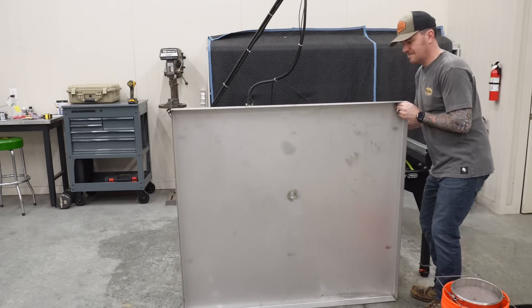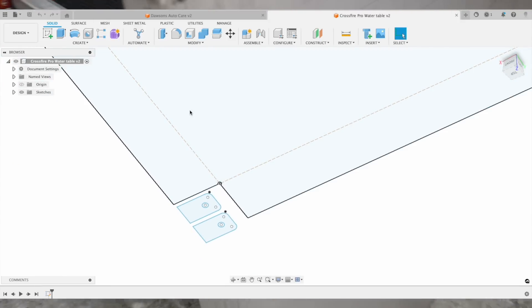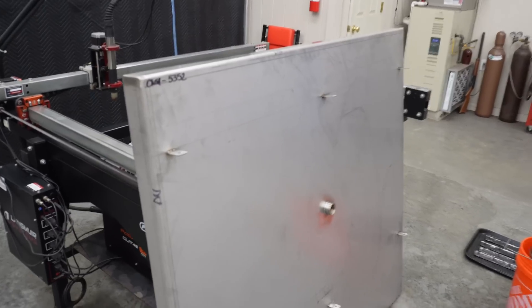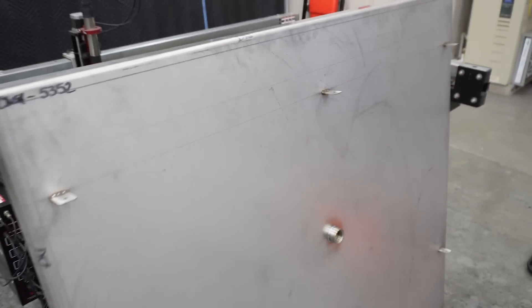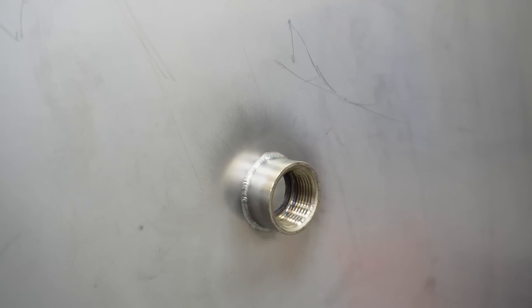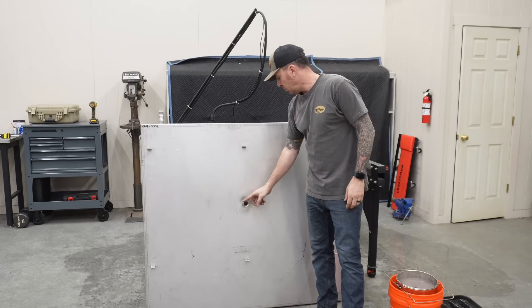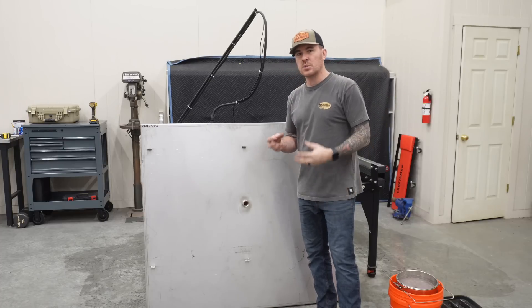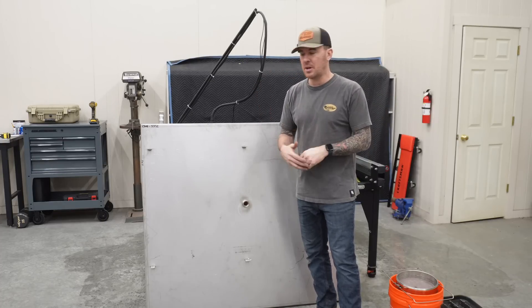In the CAD design I also had these little mounting tabs made. You can see they've scored a two-inch by two-inch line in reference to those frame rails the table sits on. The mounting tabs sit just on the inside of each rail — three tabs on each side — and those are going to mount perpendicular into the side of the square tube, so we don't have any holes in the bottom of our water table. We have a one inch NPT threaded nipple right there, so we only have one drain. I'll thread on a nipple and a ball valve. Being that it is a one-inch drain instead of three-quarter like the original, that's going to help with bigger chunks and sediment and not clog up as much.